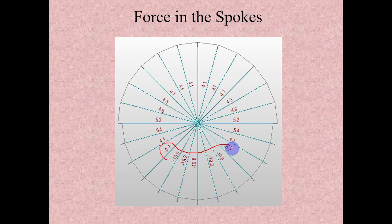As we discussed in our last lecture, when we apply some loading on the hub, all the spokes do not get equal loading because of this one point load. The spokes located very near to the ground in this particular zone have the maximum load, and all the others have the minimum. The spokes above the central hub have tension, and those below have compression.